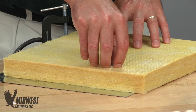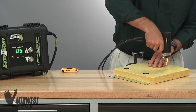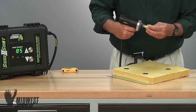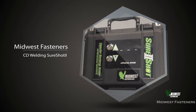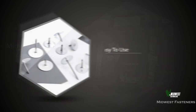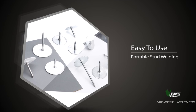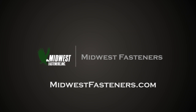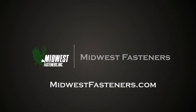The finished Cuphead Weld shows the advantages of capacitor discharge welding with no backside distortion or burn-through. The weld provides good strength from the bond and fastening is created in a short cycle which exhibits strength sufficient to support materials without falling down or pulling loose. Midwest Fasteners Capacitor Discharge Stud Welding is fast, reliable and gives superior weld strength on Cuphead weld pins and many types of fasteners. For more information on Cuphead and CD stud welding, see our industry-leading website at MidwestFasteners.com.